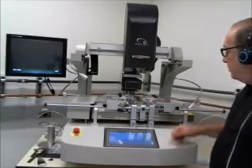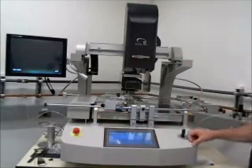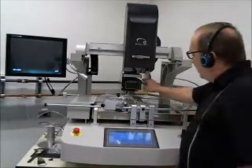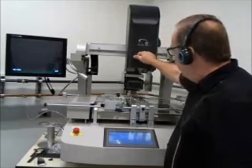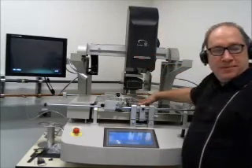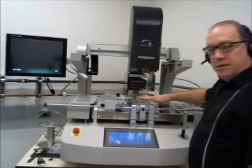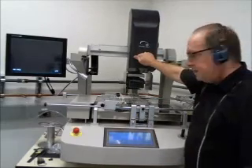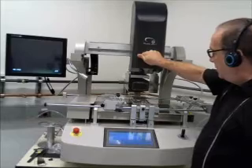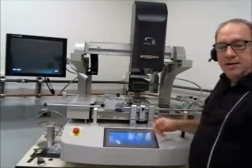The machine will do quite large boards — this one up to about 36 inches. One of the nice features is that if we have larger boards, the head will actually move in conjunction with the bottom heater. So if a chip is at the edge of the board, we can move the heaters all the way to the back edge or the front edge of the board in order to get to hard-to-reach components.